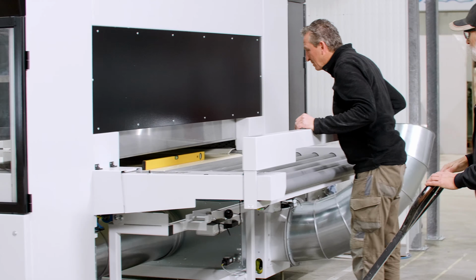If, after aligning the machine, you notice that the doors are slightly offset in height, it is because the machine is perhaps a little crooked, but it's not bad. The matter can be solved very easily. In the corner where the door is lower, you drive the pallet truck underneath, lift it up slightly, and keep an eye on it. As soon as the doors are flush again, adjust the foot and everything is good. The booth is still level, but you have a decent look on the front of the doors. To align the machine correctly, the swivel feet are also adjusted.